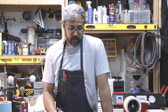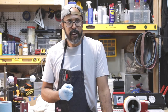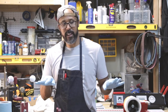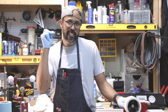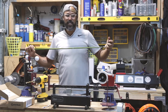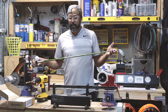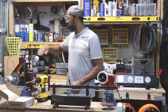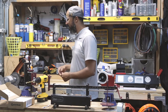That's it for Day 1. Day 2 — the epoxy is dry. All we've got to do is turn down the ferrule, clean the club up, and install the grip. The way I turn down the ferrule is I go back to my combination sander and swap out the belt for a linen belt.